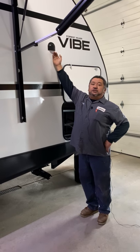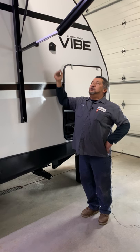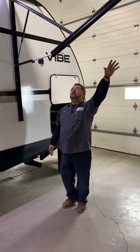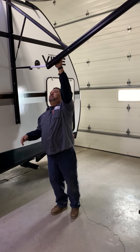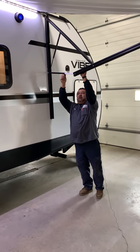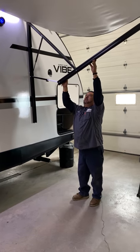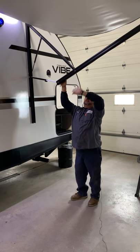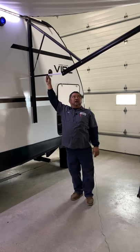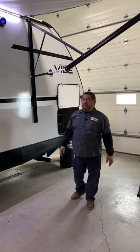This vent is going to vent your sink, so the smell of your sink will be vented out here. Your awning is going to require eight feet of clearance to roll out, and then these arms pull down so you can cant it so water can run off. If it catches a bunch of water you just have to work it off. Try to roll the canvas up when it's dry; if not, get it out the next possible day.